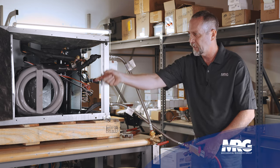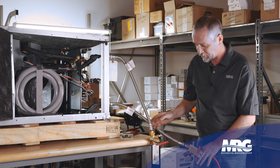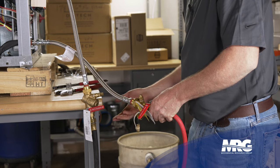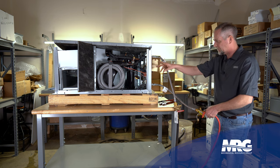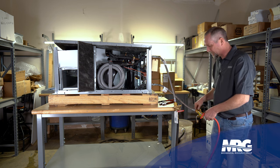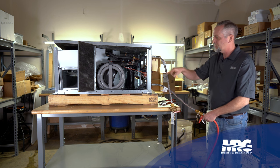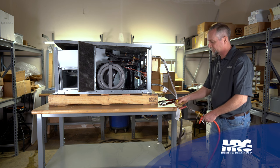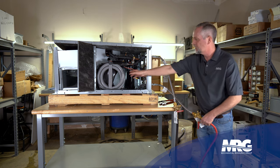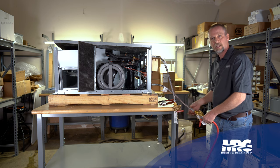All we're going to do is reverse that water flow — from going this way in to now coming this way in. Close both your valves, close this valve, open this up, get your bucket hooked up underneath because you're going to get water out. Turn this on and let all that drain out — you'll get maybe half a gallon, if that, of water that'll drain down into your bucket. Now turn the leaving side of the water on. Because this is valved off, the pressure difference won't be restricting this flow, so it'll let this water flow backwards through here and flush out all the trash that is in this little coaxial tube heat exchanger back into your bucket. You'll be amazed how much trash comes out of that.